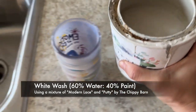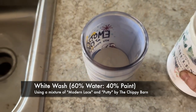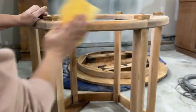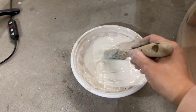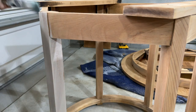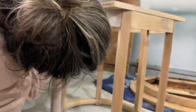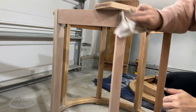It was time to mix up the paint wash for this table. To get the restoration hardware look, I do a combination of a paint wash — I let it dry and then I add a gel stain over top to act almost as a glaze. I do the paint wash mainly to remove that yellow tone of the wood, but I also feel like it gives a little bit of that rustic look to the finish. For the actual paint wash itself, I just used some beige paint that I had mixed up and added 60% water to the 40% paint. Before applying the paint wash, I just use a tack cloth to wipe off that excess dust. I use a regular paint brush to apply the paint wash with the grain and in small sections at a time, because the longer you leave it on, the less grain that will show through — so you can determine how much grain you want. After each section is done, I just use a lint-free cloth and wipe back that extra whitewash paint. You can treat it almost as a stain; that's essentially what you're doing — applying a stain over the wood.